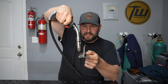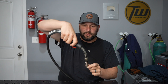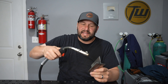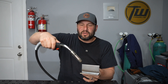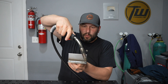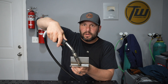If you were welding a butt joint you'd be coming straight up and down. The necks on different MIG guns are bent differently, so sometimes you have to reach a little further than others for a particular welding position to maintain that work angle — it's worth taking a little time to actually line it up. The other angle is your travel angle, in the direction of travel, and usually you'll want it angled forward or back about 10 to 15 degrees.